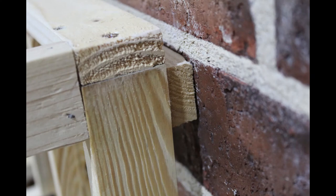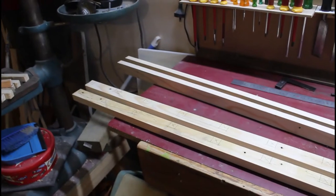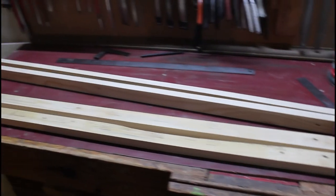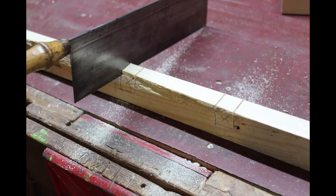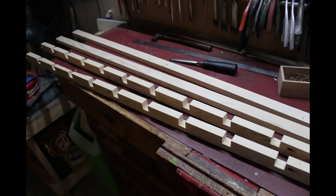We will now make some spacer pieces so we can connect all our ladders together to form our completed wine rack. For my sized upper wine rack I am using two supports for each of the front and back of the ladders. I have chosen to notch my front support pieces simply because I prefer this minimal look, but this is optional. The notches are again 120mm apart and give a nice clean look to the rack. Here you can see my completed front and back spacer pieces.